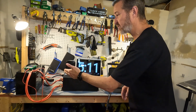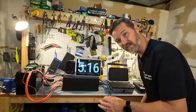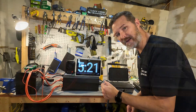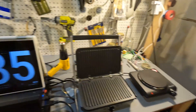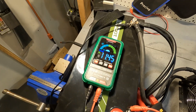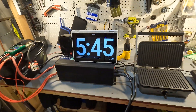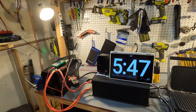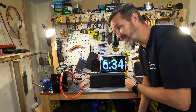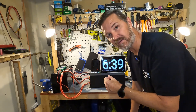We're going to introduce another thousand watts to bump the draw up to about 200 amps. With the hot plate turned on, we're now pulling 218 amps and the voltage is down to 11.45. At six minutes and thirty seconds we're still pulling 217 amps at 11.46 volts.